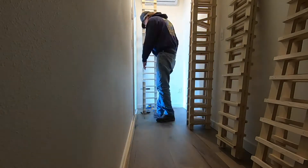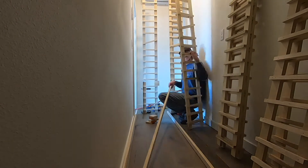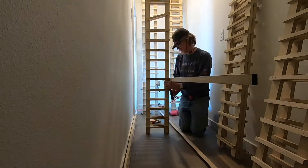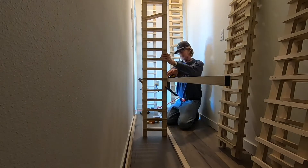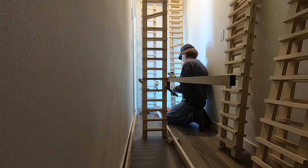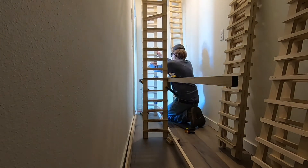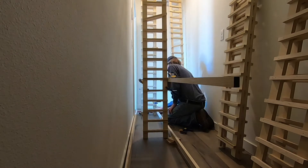This is by far the hardest part of the whole install — getting the racks to stand up by themselves. I've got a framing square clamped to that end rack, and then I'm just putting another rack arbitrarily down. You can see it tipped over. Just lining up two of the back nailers. Once I get that kind of laid in, I can then start spacing out all the ladders. I'm using little wood blocks that are cut to the right size.